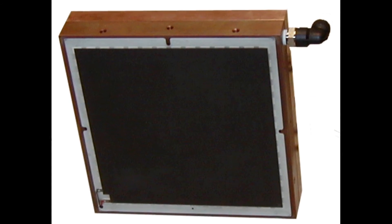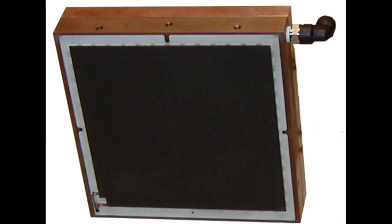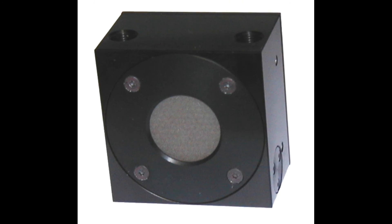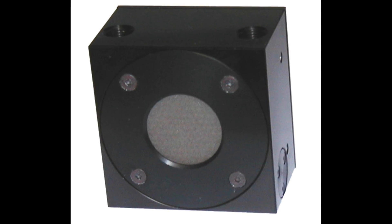And third, a sensor based on this technology can be made very large without having to be massive. Here you can see a prototype of a sensor we recently produced — it has an aperture of 200 millimeters by 200 millimeters, and can measure over 20 kilowatts continuous power, or a single pulse of 2 kilojoules. Here you can also see a small OEM sensor that measures a few tens of watts with a 50 millisecond response time.